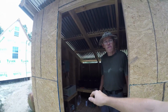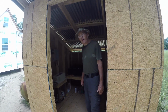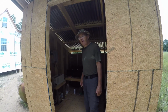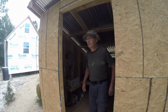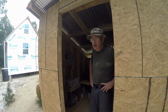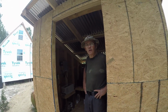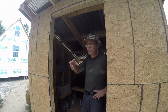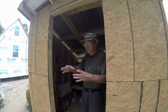All right, and I remember that because I tried to run some kind of power tool off the van, that little inverter. Yeah. And that was the problem, wasn't it? You were telling me that it was shooting up and down so much it must have blown it. It wasn't sine wave. Yeah, the inexpensive ones are not very tolerant of dirty equipment that makes a mess out of the sine wave. They'll run phone chargers and they'll run lights and stuff, but you plug a motor into those. Like a Sawzall, I think that's what I used, or a drill. It was something noisy. Yeah, drills and Sawzalls, because they've got motors, and motors have brushes, and brushes create huge voltage spikes on the wave, and the little cheap inverters can't handle that.